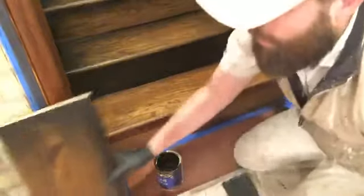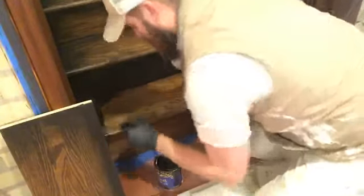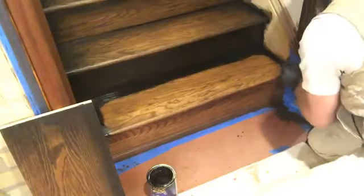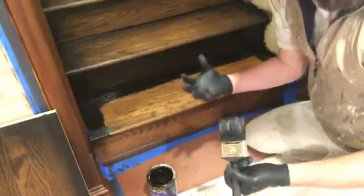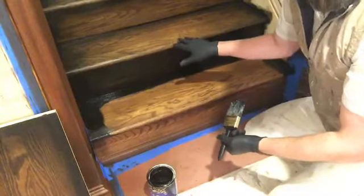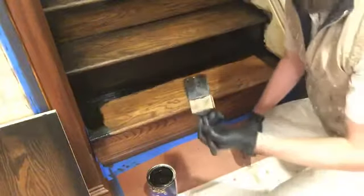And so now on this one, in order to produce a stair tread like this, what you'll do is you put it on only selectively. So we'll start at the edges here. Okay, and then you gradually move this up here, and you want to gradually feather the stain in. If you just cover this whole tread with stain, you get a very dark look where the actual tread is. And what we're trying to simulate here is 150 years of people walking down and accumulation of dirt and grime and smoke, cigar smoke, pipe smoke in the corner sort of thing. So we'll gradually feather this in.